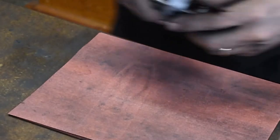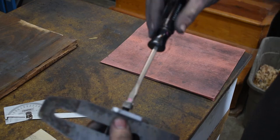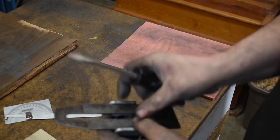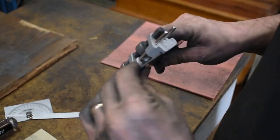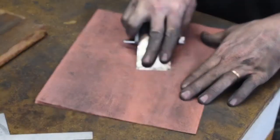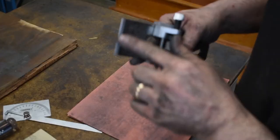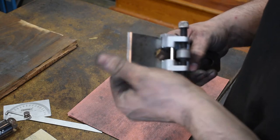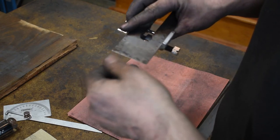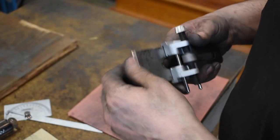We're going to stick with this 25-degree angle. Now that I've committed to it, I'm going to tighten the honing guide just a bit — not too tight, because there's no metal in the center, so you can squeeze or bend and alter the shape of it. This front bevel is jagged and I want to sand this down so the whole edge is 25 degrees. This is going to take about 20 minutes so I'll do that off camera and be back.